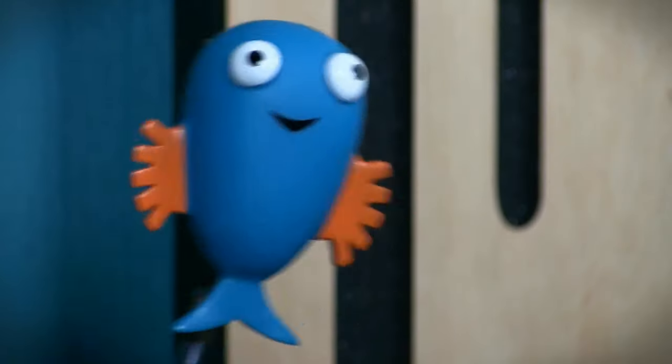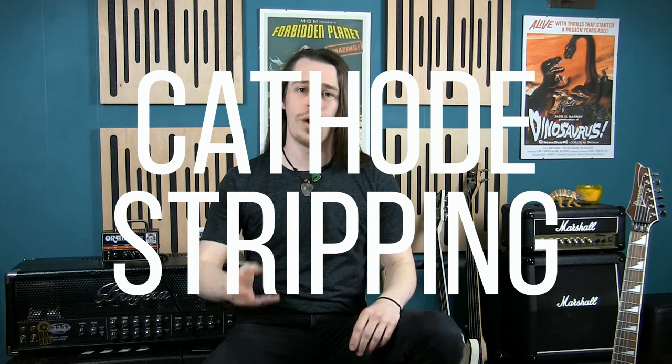But what about cathode stripping? Cathode stripping is a phenomenon that occurs when the plate voltage is applied to the valve before it's fully heated up. This results in ions bombarding the cathode, stripping away its coating and leaving you with a broken valve. Now this is a real concern — for exceptionally expensive, exceptionally high voltage valves, ones running above a kilovolt, are susceptible. Comparatively, the valves in your guitar amplifiers are much cheaper and running at a much lower voltage, quite often below 500 volts. So there's absolutely no risk of you stripping the cathode of your 6L6 power tubes by not adhering to the myth of the standby switch.